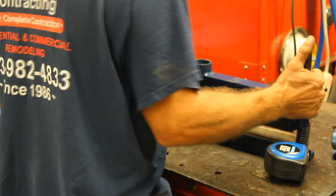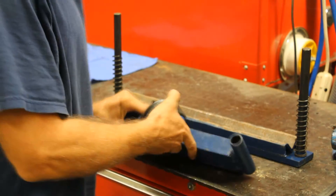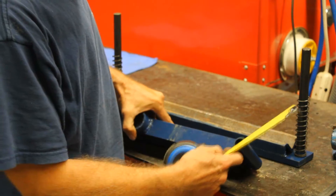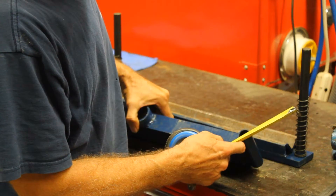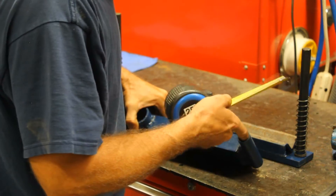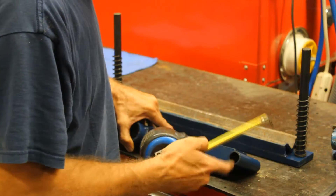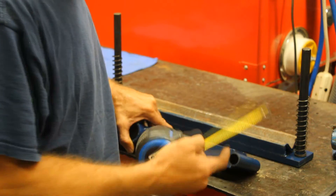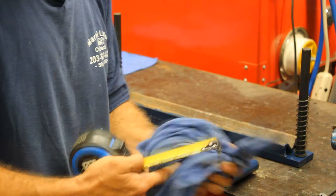These pipes are three quarter inch black pipe — NPT black pipe. The ID on these is just a little over three quarter, it's like 13/16ths. But there's typically a seam on the inside of these, so you have to be careful when you pick out your black pipe. Make sure that the seam isn't protruding too far into there. Or you can get just some DOM tubing.